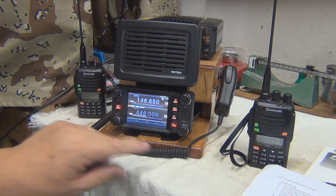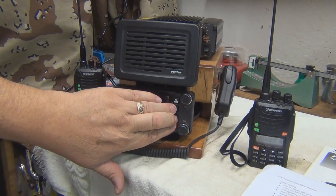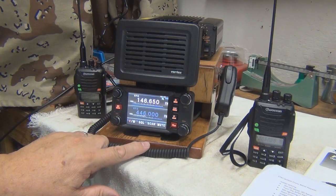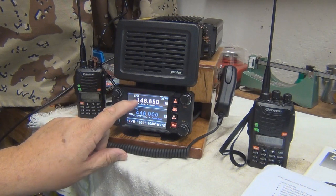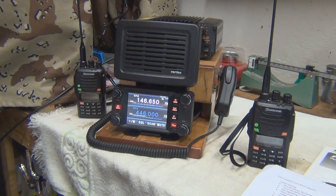To turn it off, you have to turn the unit off, press the same three buttons again, and then turn it back on. You'll see that we're no longer in that mode — there's no mode shown. It's a simple process; you just have to have everything set up correctly. Again, if you're going to a repeater or some other mode, you have to program your repeater correctly with your offset. Or if you're going from VHF to UHF, you have to reverse the process and have that offset programmed.